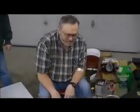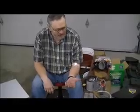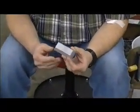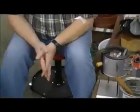One of the questions folks generally ask us is, what will it power? Our engineer Dave was telling me about an application he used it for — his experience actually smelting some lead with the unit. After we first built the prototype, I was curious just how much power this thing would supply. So I hooked it up to my lead-smelting furnace, which is a continuous load of about 700 watts on high. Running off of nothing except the batteries in our unit, I was able to melt 30 pounds of lead and keep it melted long enough to pour it into one-pound ingots. That took about three and a half hours one evening. When I got done and finally shut the process down, the unit still had plenty of power left, so I hooked two 75-watt light bulbs up to it and left them on all night long.